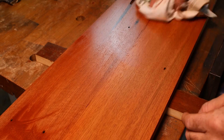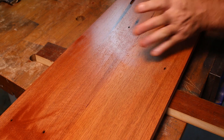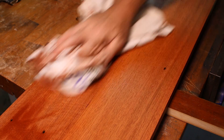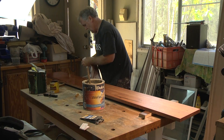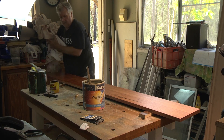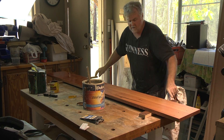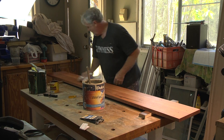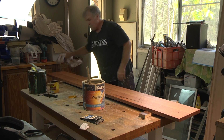Also, when you're wiping, you go with the grain. Can you see that? That means I haven't wiped it clean enough — you can actually see where I haven't wiped off enough of the stain. Also it's going across the grain. So you just kind of rework your rag and go over it with the grain. With the two bits of timber, it allows me to actually work on the edges a lot easier. I'm constantly changing my rag, getting a nice dry bit on there, and I'm not pressing very hard — just enough to soak up that excess stain.